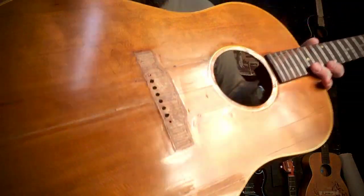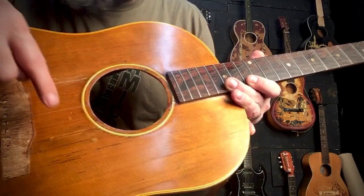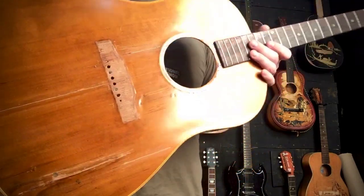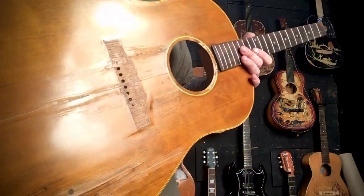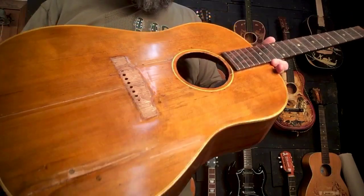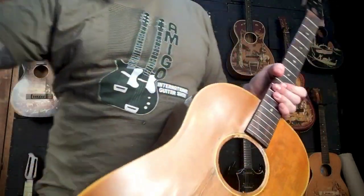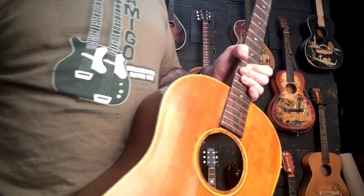A fun thing about my situation is I have another project J-45 from the late 40s that was in similar condition as far as being all apart, but it was in good condition — nobody had worked on it. This one has all kinds of little holes where somebody had mounted pickups, and those had been drilled through the X-brace, so the X-brace was busted. There was really deep sanding and all kinds of knobs that people had put in here at different times, so the inside bracing was pretty much trash — nothing salvageable from the internal bracing.